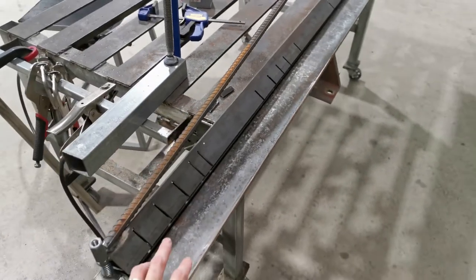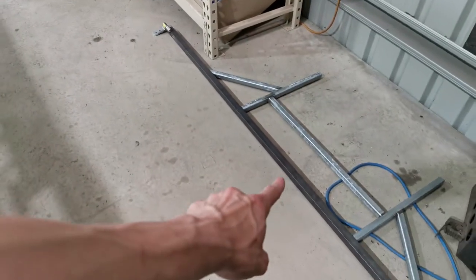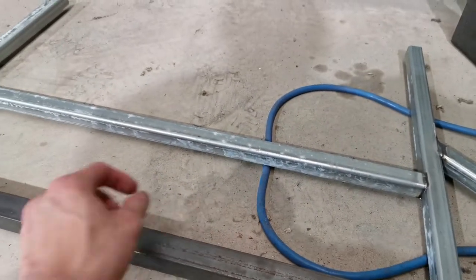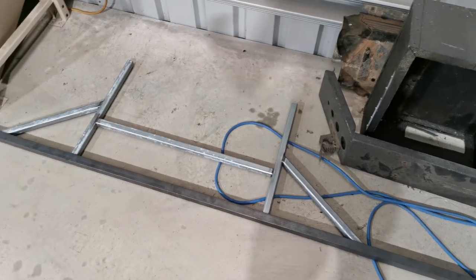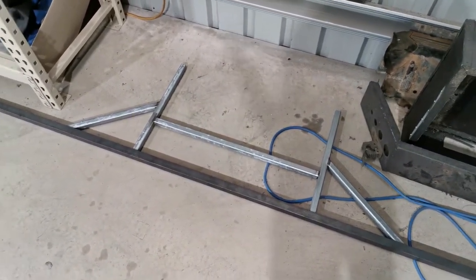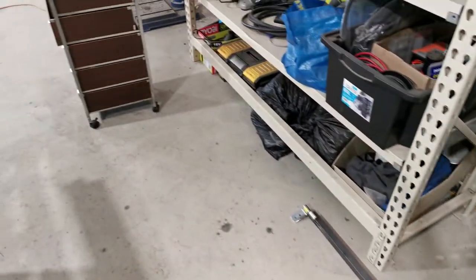Number one, firstly, the folding bit, that is the movable part. Previously it was this. I've taken it out because it's essentially too flimsy. If you recall, that thing actually is only 3 mil. I didn't actually notice how thick that was. Even with all these strengthening attachments, the whole thing just flexed, and I couldn't use any strength at all to bend any metal. We're talking about half a mil of steel, 1.5 mil aluminium. So it was a failure. So that's problem number one.